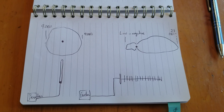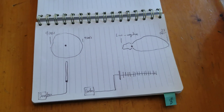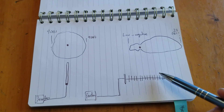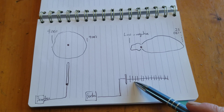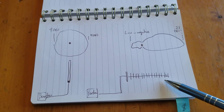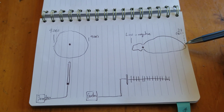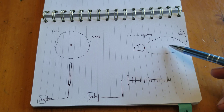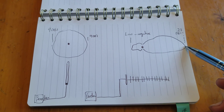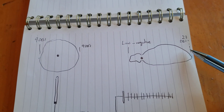Most of you probably aren't antenna radiation pattern people, so I've drawn a couple of pictures. The Yagi antenna provides amazing gain — here's a rough diagram of the radiation pattern. This RF Solutions Yagi is an amazing antenna. If you're pointing it at the source, and you're in the direction the antenna is pointing, you can get as much as 23 dBi increase in gain.